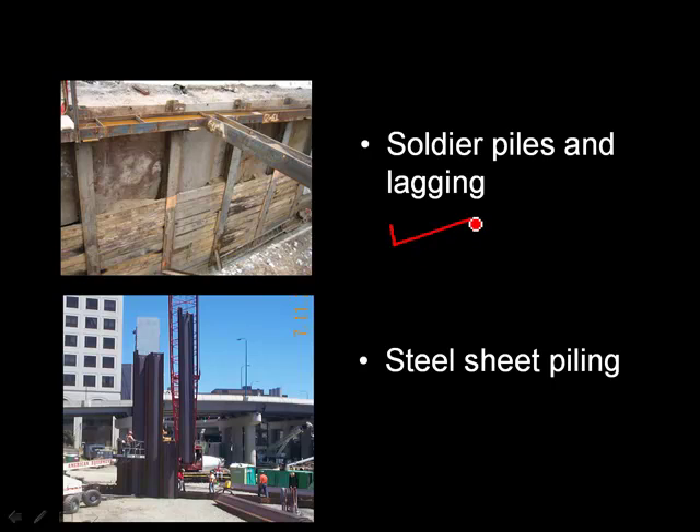When the excavation is too deep or too wide for timber sheeting, you need to go to more robust material. The system that you would typically consider is soldier piles and lagging — now you have steel members, you can go down deeper, and you can brace a much wider trench. This system also can accommodate utilities, making it an extremely versatile and valuable system.